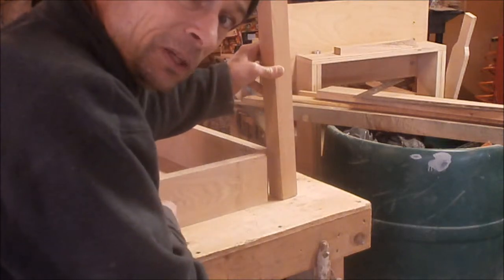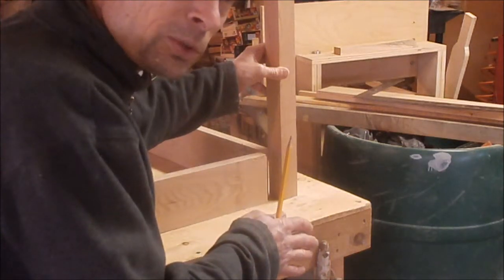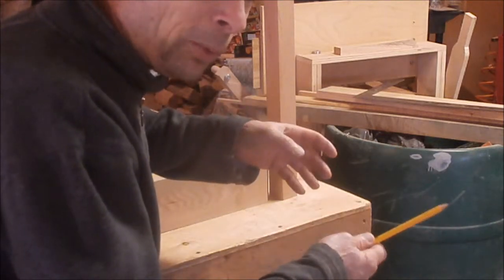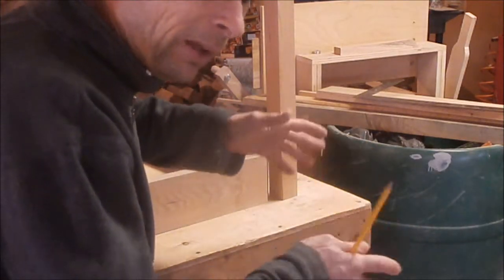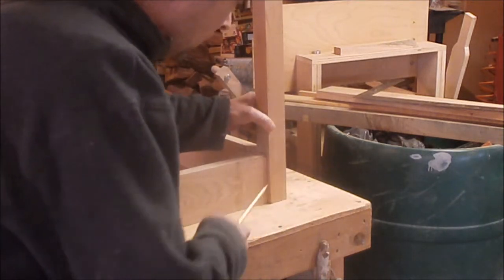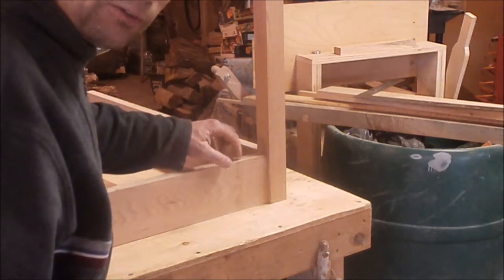But the same thing happened to these pieces. What happens is you're sealing in whatever moisture is in the wood so it doesn't crack anymore or rot, and it keeps its shape because it's not losing humidity. When you see a piece of wood starting to bow, it might be absorbing moisture or releasing moisture on one surface, creating one surface to be elongated and the other one getting shorter, so you get bows and cracks. But if you can do every surface on your pieces, you eliminate that from happening. So this is what the corner is going to look like, and I'm going to leave a quarter of an inch from here to here, and now I can figure out the measurements of the side pieces and the front and back pieces.